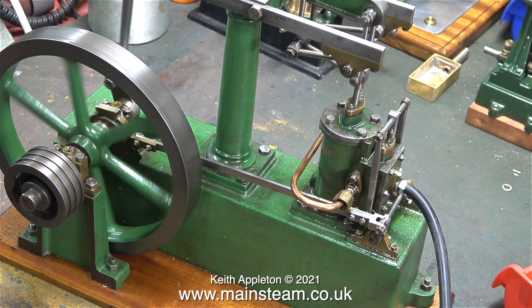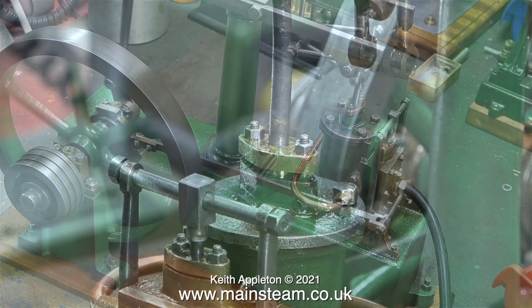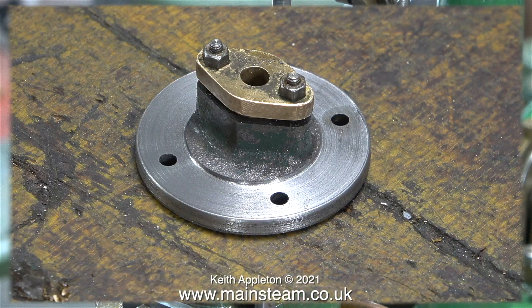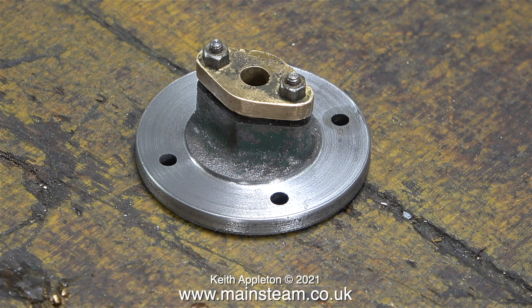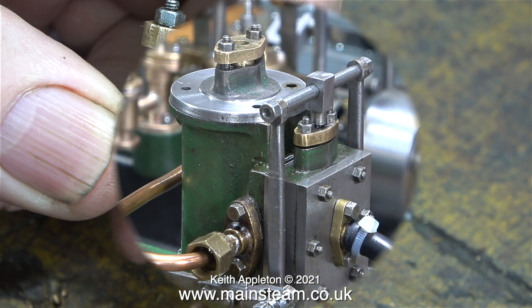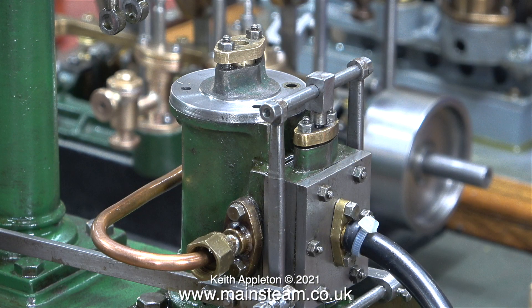This old beam engine needed quite a lot of attention. It looks okay in this image, but it really isn't. During the restoration of this old engine, there are quite a few top tips that are not always obvious. The way the top cylinder cover is bolted to the cylinder is not good. Here's the top cylinder cover before I machined it, and you can clearly see the slope on it is a real problem with the bolts. Now it looks like this — I couldn't machine around the edges, I just had to use some emery cloth, because it was exactly the size of the cylinder. This is a much better arrangement, more like the full size, and once the centre part is painted green it should look very nice. Definitely worth the extra effort.